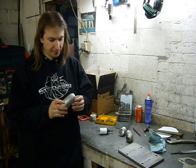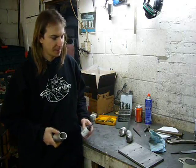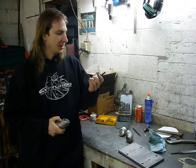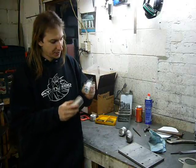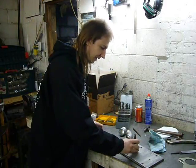I'm building the turbo manifold out of 1.5 inch Schedule 40 304 stainless. Of course, Schedule 40 1.5 inch is actually 1 5/8 inch internal diameter. So I picked up a new hole saw that fits the pipe perfectly, and now it's time to hole saw the flange.